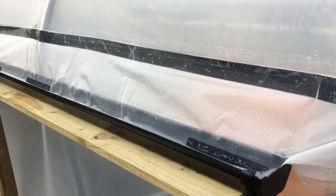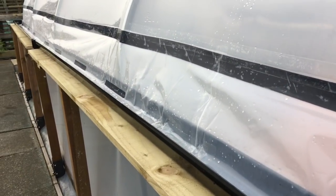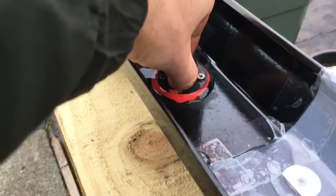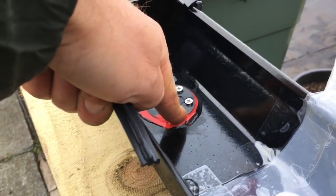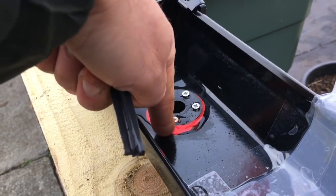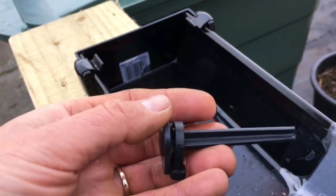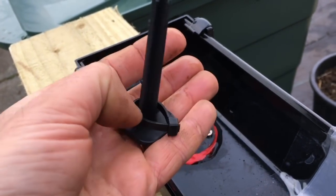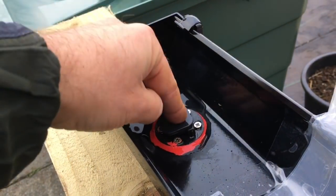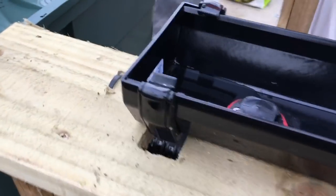We've just tested it and get a pretty good flow rate — about 10 litres per minute. The gutter will take that and works pretty well; 10 litres a minute is a heck of a lot of water, so no problem there. At this end I've just got a little pipe flange screwed into the wood, sealed around with waterproof adhesive, and then a little landscape fabric peg with a small loop around it to hold it up — that just stops leaves and debris going down the tube.